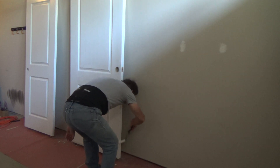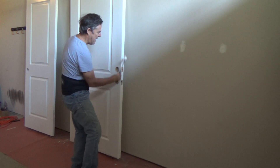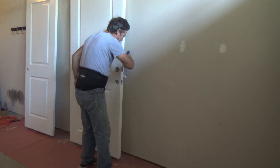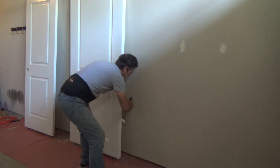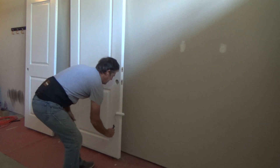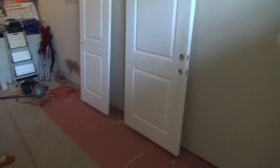I can run the roller down this way — however way you feel comfortable holding the roller. Now I can run it upside down. Because I'm doing the roller without the extension pole I can do the front edge just nice and easy, hardly putting any pressure on it at all. That is not leaving a buildup — I've got a nice coverage of paint on the edge of the door, and no lines.